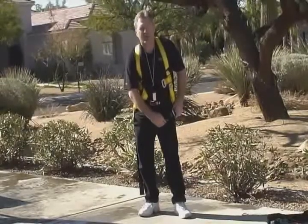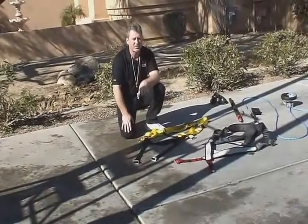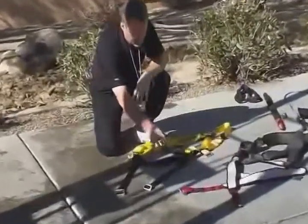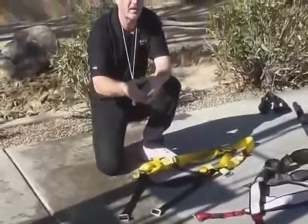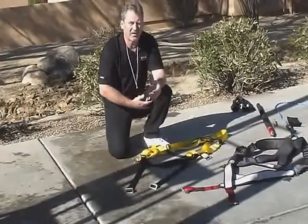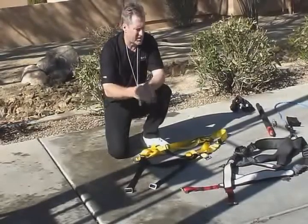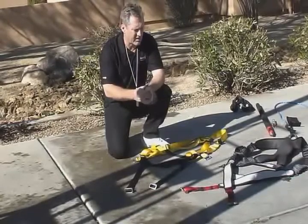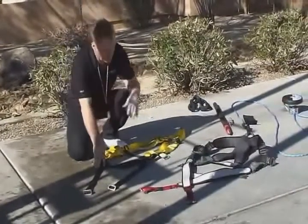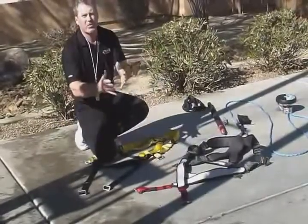Let's keep in mind that we also want to bring the leg straps up where they should be. A lot of the old-style harnesses, especially when not adjusted properly, can act as a tourniquet. You have these inch-and-three-quarter straps that have a tendency to act as a tourniquet on the leg when someone's hanging for a while. The blood will pool in the legs, becoming toxic, blood clots can develop, and we've had a few suspension trauma fatalities in the industry. To prevent that, you'll see companies making the surface area around the leg wider to allow blood flow to pass through.